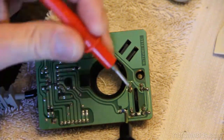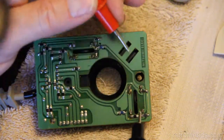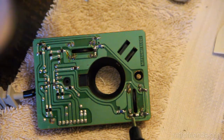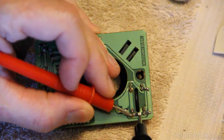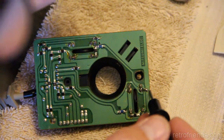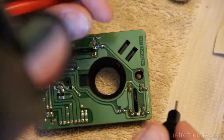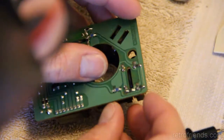So I went down here to the one that's not functioning, and I measured this, and that is again a dead short. And just to see if it's a diode, move it around the other way, dead short. That's what I did above. And then this one here, this is laid out a little bit different. This one's supposed to be 330, I think. It is. And this one's supposed to be the 1.5, I believe. 1.5. Okay, so these solder joints are really crusty.